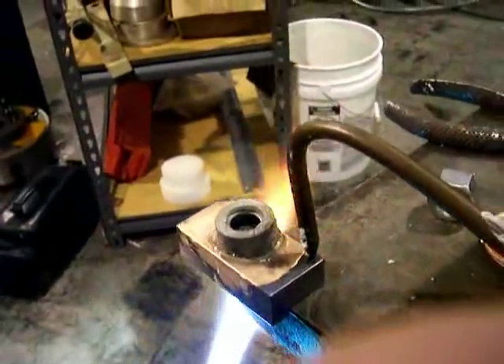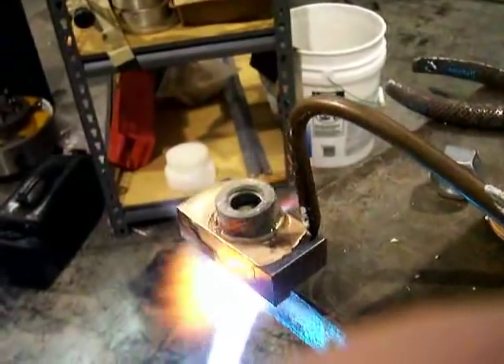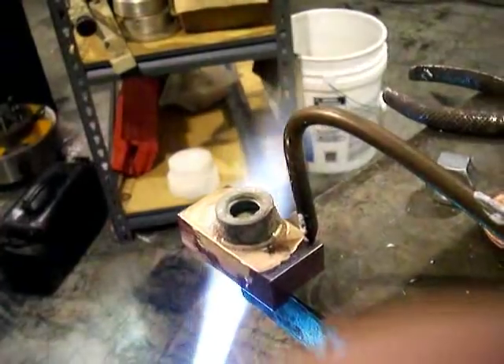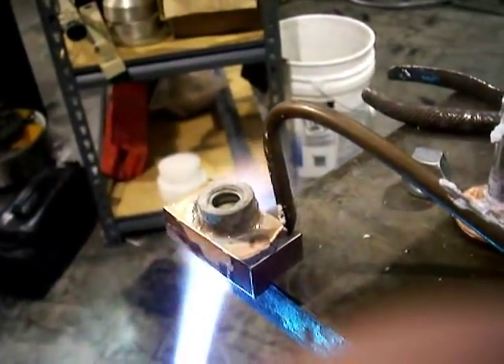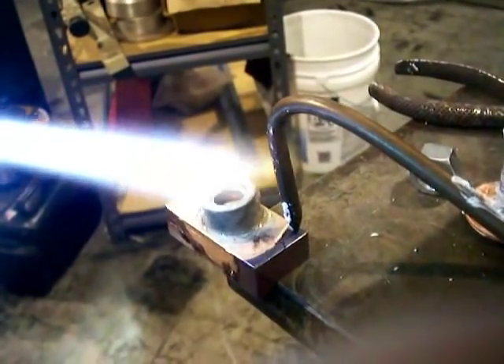I make sure to throw a little heat on that carbon because it's going to need a little bit. Watch that piece of braze material — it's getting ready to melt. And there it goes. It worked. Melted in there all at once, flowed right in that joint.